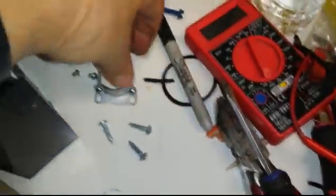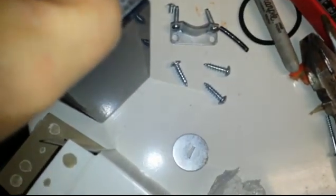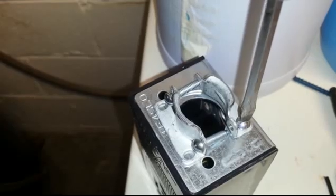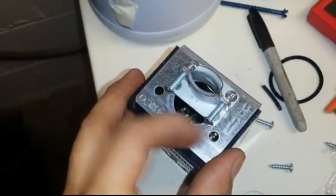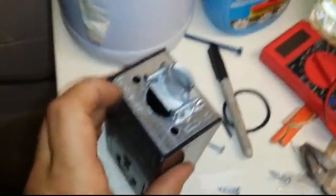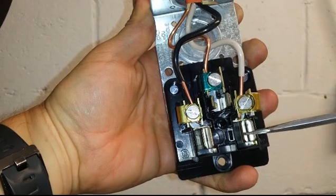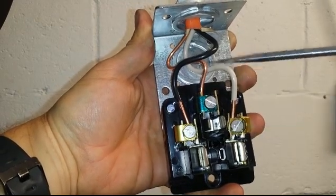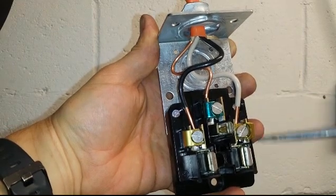This box is pretty awesome — it even comes with its own wire retainers built in. That goes right on there and then you screw it in right here. The screws go in here and then the wire goes in there, and then I tighten those screws down and that holds everything in place. Here you can see I've got everything wired up — the hot leads going to the contacts, the ground going to the middle. I tested continuity to make sure nothing was shorted from any of the contacts to the ground or to each other, and also made sure that the wires going to the leads have good conductivity.